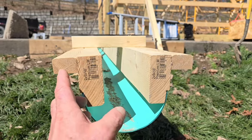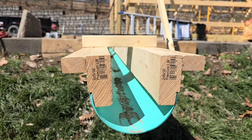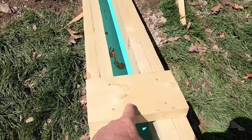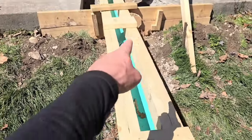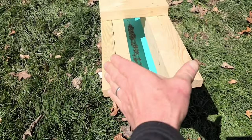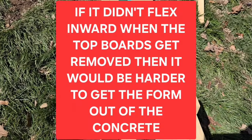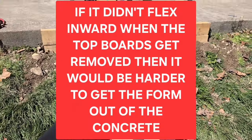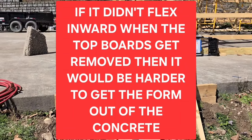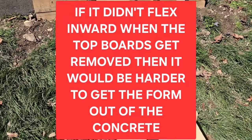And we'll be cutting bar grating. I think what he's got from right here to right here, he said was 9.5 inches. And it's probably an important part of this to see these. He's got these on here, and that's holding the width of that, because this would flex, you know, and it could be wrong. So he's got these cut 9.5 inches long exactly, so that if you got that flush to the back of there, it's going to maintain the width of the thing. So you're even all the way across there.